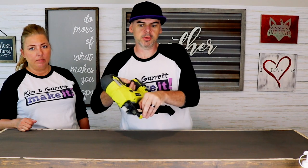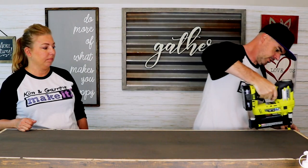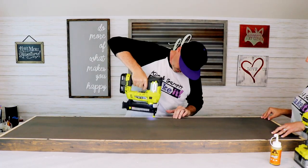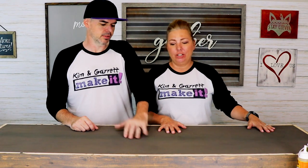All right, coming in with a 3/4 inch brad, just around the edge. I think we gotta leave it for like 2 hours for the glue to set up and cure. And then we're done. Then we'll flip it over and show you what it looks like. All right, we'll be right back.